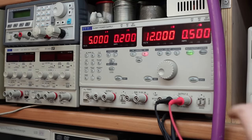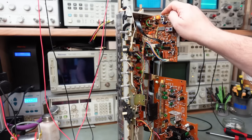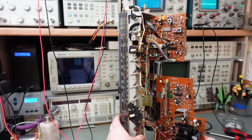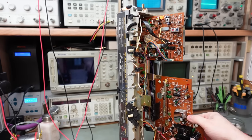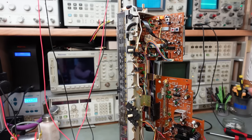Now it's back in — let's see if we've still got the problem. The problem's gone! That's good news. Try the old shake test — give it a bit of a bend and a tap. It's holding steady, can't make it go wrong — unless I put my hand on the back of the amplifier chip itself, but that's nowhere near the levels it was before. I think I've disturbed some dodgy soldering, and I'm pretty sure that's the root cause of the original failure. I'm quite happy that problem's been sorted.